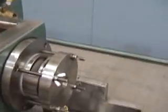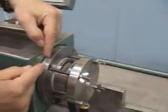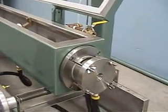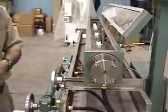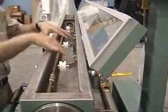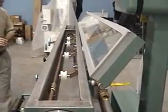Now an adjustable tool, it's about a 1" 12 thread, and what we could do is we could walk the vacuum closer to the extruder or into the water well or back it off depending on how quick we want to pull the vacuum versus the water on the product. Now once we're in the vacuum sizer, we just have hold down rollers as usual to hold the part from rising above the water level to keep it from distorting.